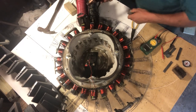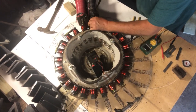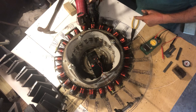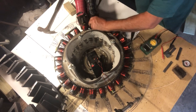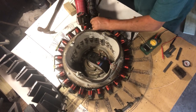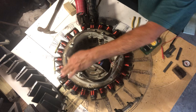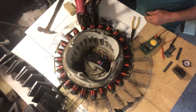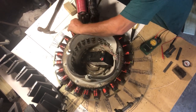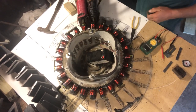When I'm done with this I'll post this video. I'm going to lower the stator back down and start winding some coils. I'll start off by winding just four coils — one here, here, here, and here — and we'll do some studies with them. This is going to take a long time to wind all those coils, and to tell you the truth, I'm not sure if I have enough wire. I'm going to wind it with 16-gauge.